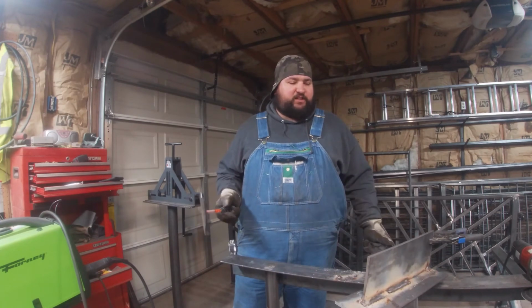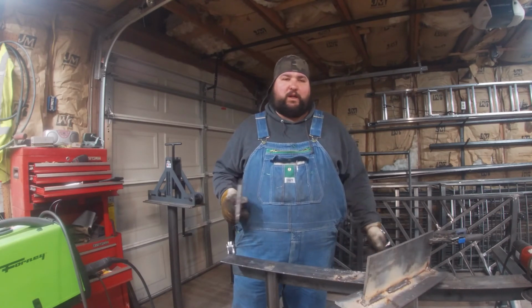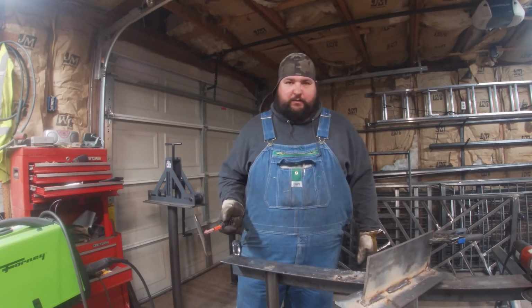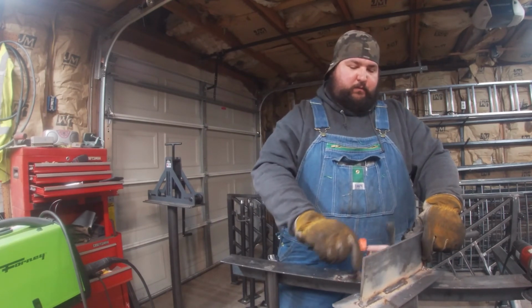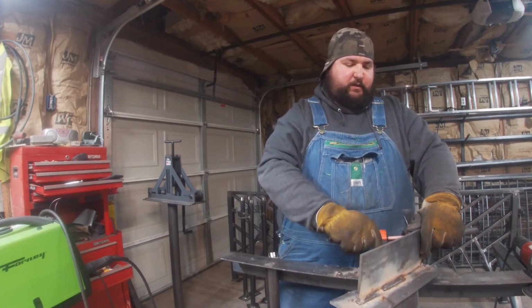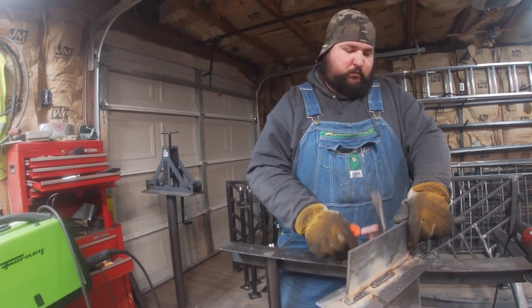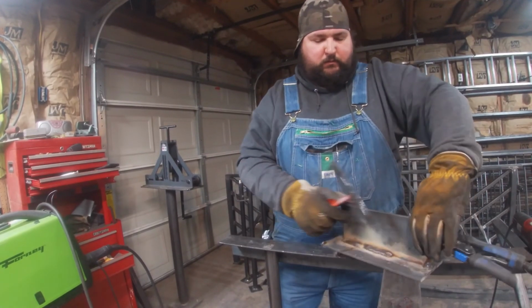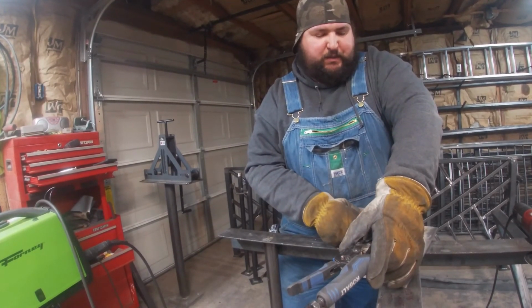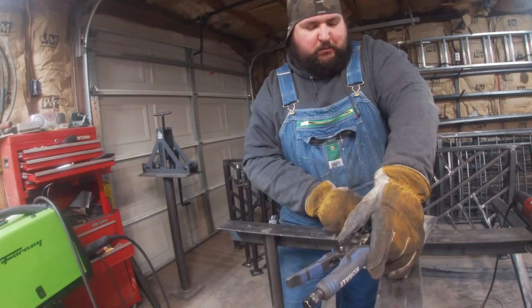So the next step we'll do is we'll chip the weld, and then we will actually closely criticize these welds and look at what the different methodologies were and the desired effect. So let's go ahead and chip the flux off, and just be careful to chip away from you. That way you're not getting any flux and any slag. You can see the pair of pliers that I've got on this plate, which come in handy, because especially stick welding burns really hot.